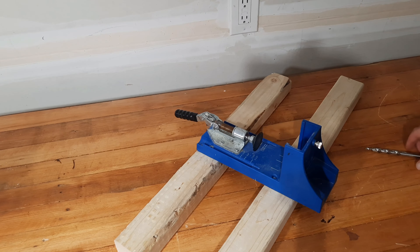Now comes the most important part of the setup procedure: setting up the drill bit to the right depth. We are using inch and a half here, which is a little bit difficult to see, so we'll base it on an inch and a quarter on the setup. The shoulder of the drill bit — you want that to line up with the inch-and-a-quarter line. If we were drilling inch and a quarter, I could tighten this collar down here and that would drill a perfect hole. But since we're going through inch and a half with a two-by-six, you push it all the way up to the inch-and-a-half setting, then tighten the collar.